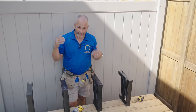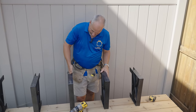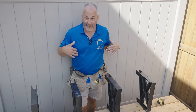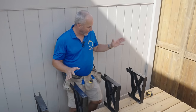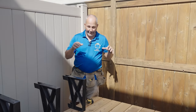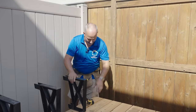I'm just going to try to really pay attention to my order of doing things. I get a 2x4 that comes in the back of this slot, and it follows my arm on an angle, so for a backrest. And as soon as they're installed, I can't be here. So I got to kind of install those on my way out, which means it's probably best for me to build this inside table, get this in place, screw it in place, and then I can continue working on the rest of these benches from the surface of the deck.